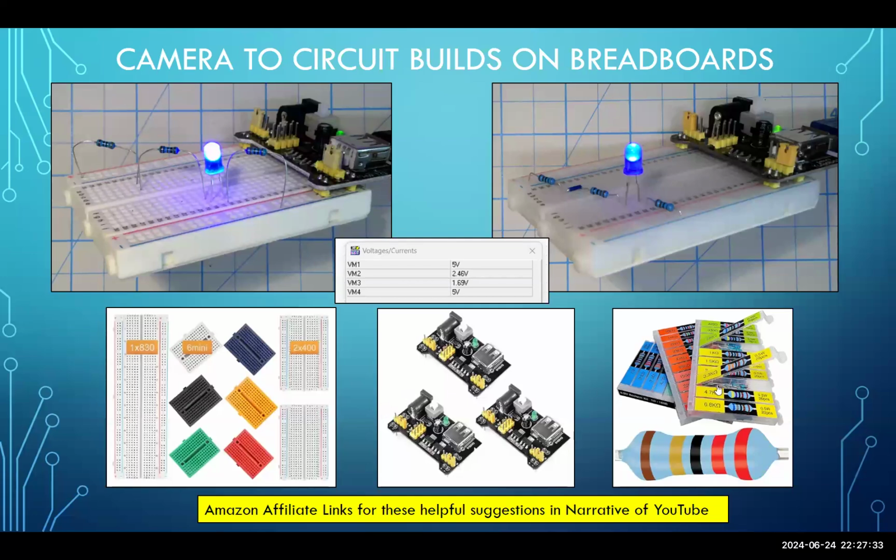And most interesting and useful to you will be having physically larger resistors. They're the same metal film resistors. They're very precise. They're 1% tolerance, plus or minus 1%, as opposed to the plus or minus 5% carbon resistors. And they are individually segmented into separate compartments in this particular kit arrangement.